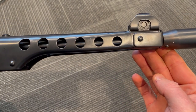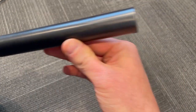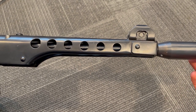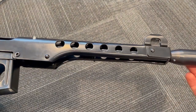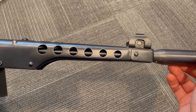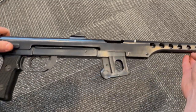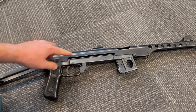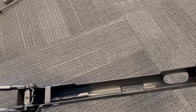Once you're done welding and grinding, everything should look fine. I did my front a little different — I have a pinned and welded barrel extension, which is just a hollow tube. My shroud is cut back about 0.6 inches, my barrel is threaded to half-28, and I pinned and welded this barrel extension on to get to my full 16-inch length. It's a little different, but it's what I needed to do to make it legal and look good. I actually welded around the inside as well, so the inside is nice and clean.